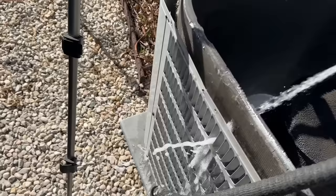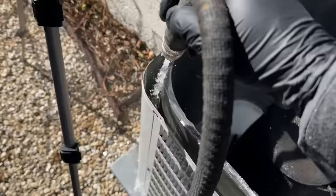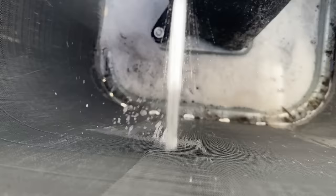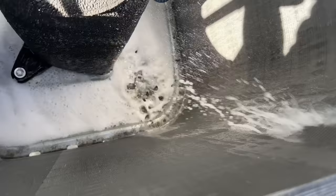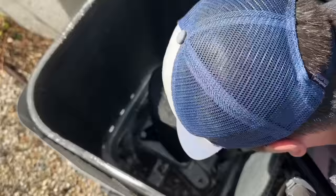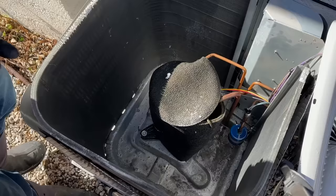As we're doing it through the inside, we're going to push any contaminants out of the coil — that's the advantage to doing it that way. But if you don't choose to take the top off, you can do it from the outside and just force anything down the coil and it's not going to be a problem. My condenser doesn't have any holes down here, so I'm actually going to grab my shop vac and suck all that stuff out and make sure that the bottom is nice and clean.